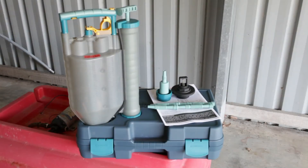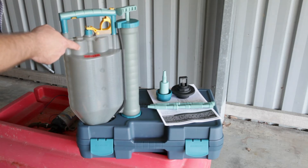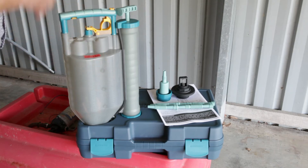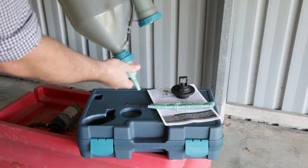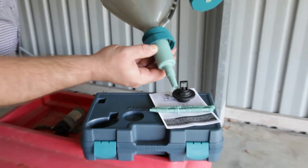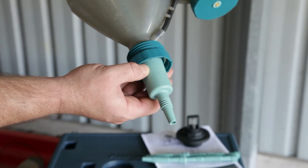Just a few technical points about the EnerBranch Liquid Handling System. All the air drawn off via the pumping process is brought up to the top of the vessel. There are two centrifugal vortices that flow through there, so if there are any bubbles in the chemical they get broken out, and consequently when you're emptying, that gets sucked back into the main vessel and out to your application point. That air then passes down this tube through the nozzle — there's a small hole up in there that sits inside your container, so all the air you're drawing while pumping is going back into your container, meaning the vapor is closed as well.